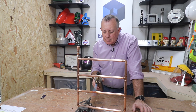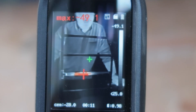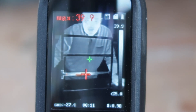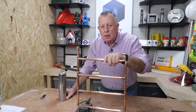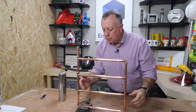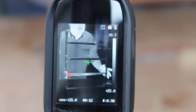First, without the water. I held the flame for ten seconds. On the infrared camera it's pretty hot and still quite red. I wouldn't want to touch that — it's red hot and I can feel the heat coming off it. The top is still totally cool, a bit warmer in the middle, and obviously warm where it was heated. Although copper is conductive, it's not really taking the heat away particularly well. Let's fill it with water and see if there's a difference.